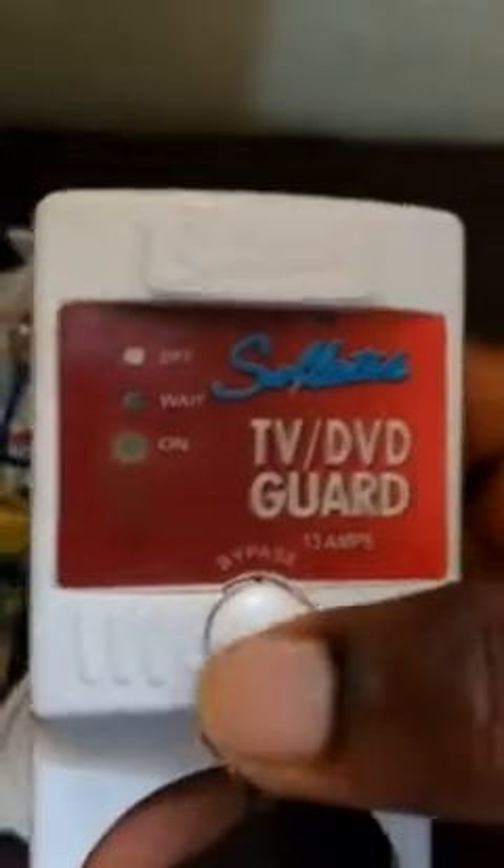I also discovered this unit is not the original, because there is a bypass overload delay reset button here — but when you look inside, the reset button is supposed to operate on a switch at a certain point. However, there is no switch or component that the button actually controls. So this button is fake — it is just here for appearance and is not controlling any switch. I'll consider that next time I'm buying this kind of device.